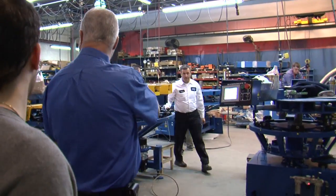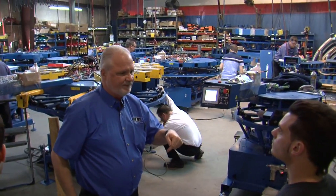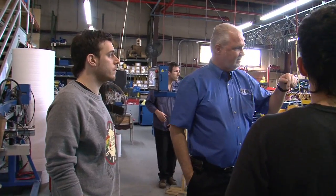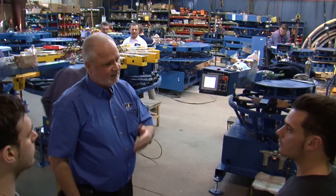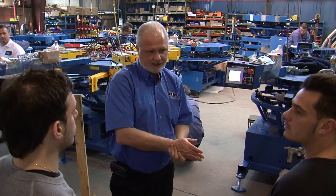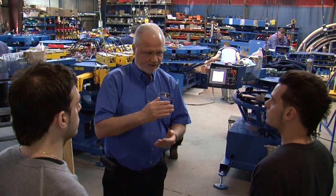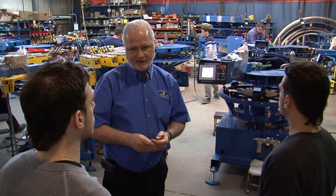As the machines go through the process, every machine is registered here. The assemblers will register to a tolerance of under 1/1000. Then upon shipping, when it's installed in your facility, the tech that does your install will double-check your registration to make sure that you're under 1/1000, because the machine cannot leave here if it's over 1/1000 in tolerance on the registration.